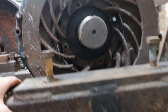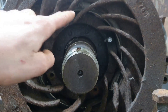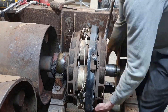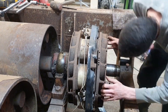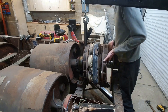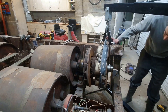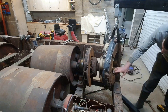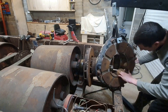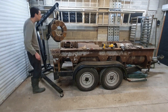Those three bolts are all out but that one isn't. I have managed to get the nut off the back side, so if the bolt isn't too seized in the assembly then this disc should come off now. This is the real crux of it — once that disc comes off, the eight coils can come off as well, so that's really quite a big moment. There was still one fairly hefty job while that internal disc is free — it won't come off past the hub, so there are eight bolts to get that hub off. Look at this thing — what a great moment to have it free. Very flippin heavy — that thing must be 100 kilos.